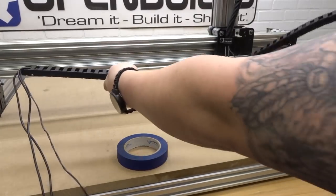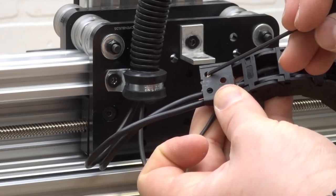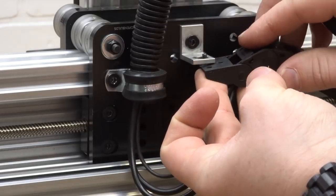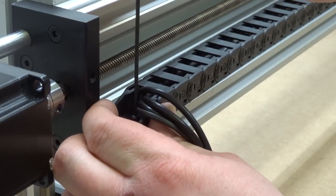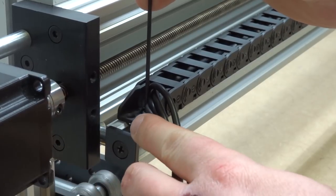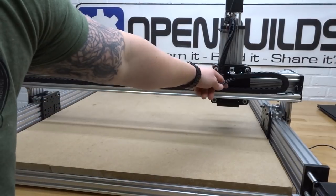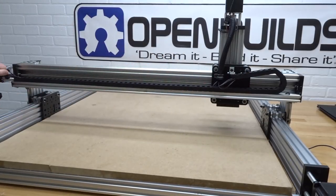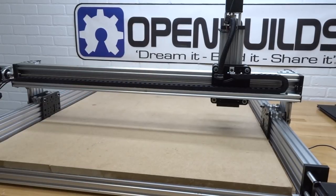Set the opposite end of the drag chain aside. Take the top end, place it on the single L bracket using the right hole, run an M3 8mm screw through the drag chain and through the bracket, tie in the M3 T-nut on top, and tighten. Leave about half an inch between the end cap and the drag chain to avoid putting too much strain on it. Pull any additional slack through from the other end. The X-axis drag chain is now assembled and it looks really sharp.